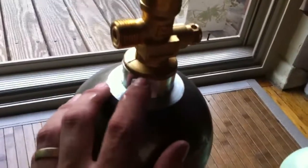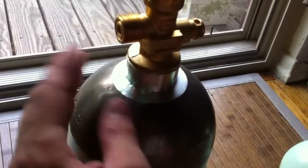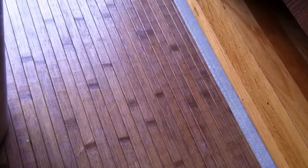I heard a hissing between the valve and the tank, and I could actually feel a little bit of the CO2 shooting out. I felt like going out to my truck to get the proper bubble testers, but I just used a little bit of dish soap instead — let's see how bad this leak is.